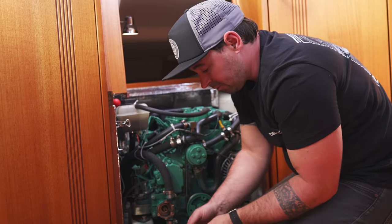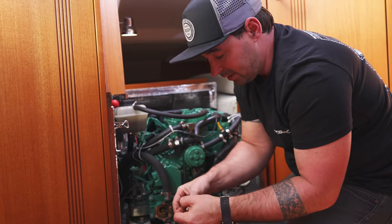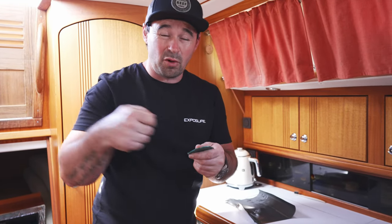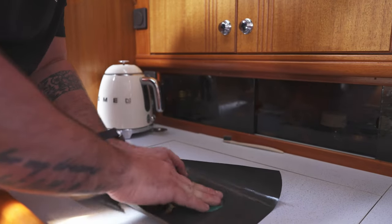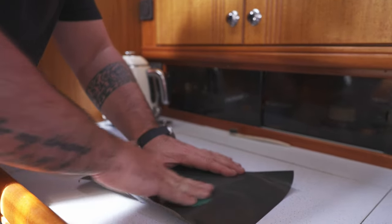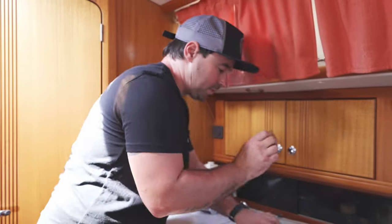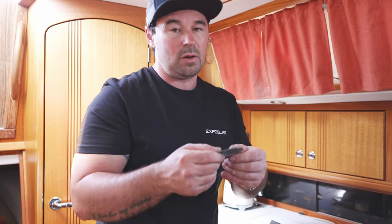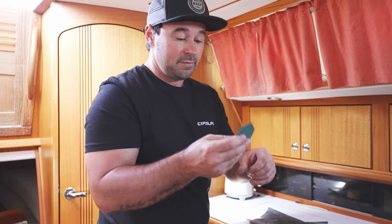The face plate — this one's got a paper gasket on it. We need to remove that. Some of the paper's hard to get off the back, but what I don't want to do is gouge it with a screwdriver. So I've got a little bit of 500 grit sandpaper, and I'm going to put that on a really flat surface and just gently rub away. That means any undulations in this I'll be taking out, and I'll be making it flat because it's on a flat surface. Straight away we can see that's made a big difference — just a little bit, don't go mad. These things will last forever if you look after them.